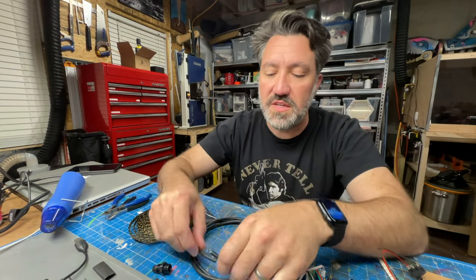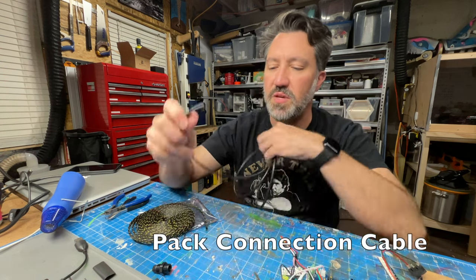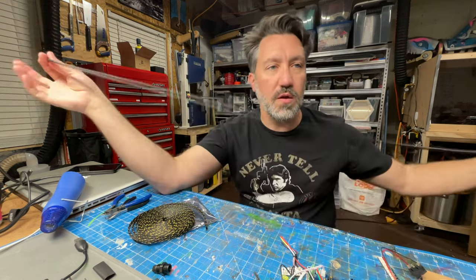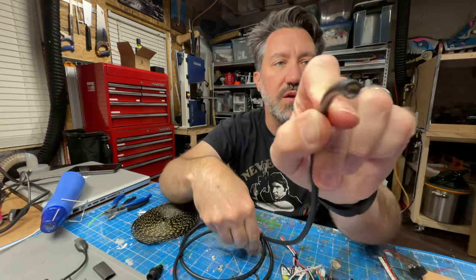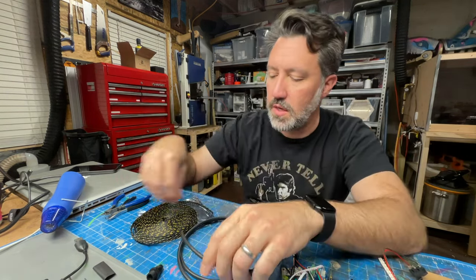What I want to do next is get the wire kit worked in here. Everything that connects to this has a strain relief boot — designed so wires exit right between the toggle switches. That's why it was placed inset from the side: it gives clearance on the inside for the nut. Once the wiring is attached, I'm going to show how to wire this up and make this my test rig dummy plug. I'll keep this side attached to the test kit, and anytime I want to test the attenuator I just disconnect from my real pack, plug this in, and go. The next phase is making the four-conductor jacketed wire that will connect the attenuator to the pack.